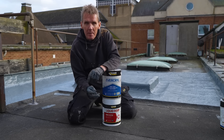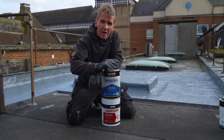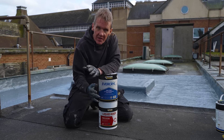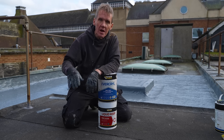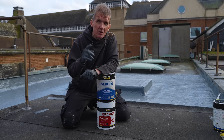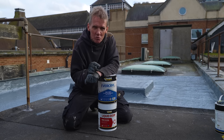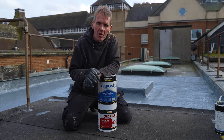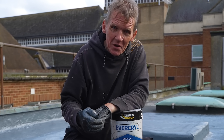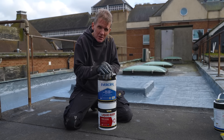Let me say one more thing about this polyurethane coating — it's not only for repairs. I have actually seen it used on a new roof. If you've got OSB or plywood on there, you can go on with the polyurethane without needing the reinforcing fleece — you can just paint it straight onto the timber. I actually saw it being used some years ago on a church roof where they'd had the lead stolen so many times that they decided to paint it with the polyurethane product. I've been back to look at that church roof and it's still good — still doing a great job and not leaking all those years later. I've got a little bit left in the tin, so I might as well go around and do all those other little bits and pieces I can see.